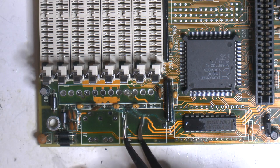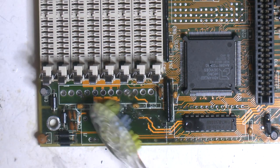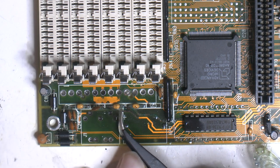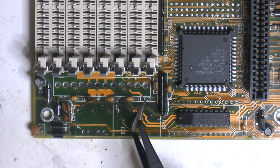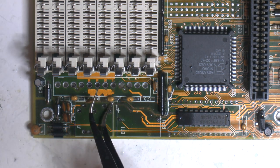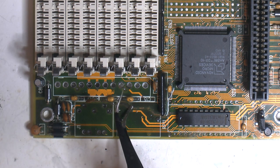Make sure there could still be some top coating left, so I can't scrub this corrosion away, but I don't think there is. It's just very thick corrosion. I'm gonna have to tin this and wick this later. Get even more corrosion away, and once it's all taken, tin solder, we can do a final soldering of the traces to basically give them a new coating of the metal layer, taking the copper with some tin, and at the end we can conformal coat them so they are protected even more. But that will be probably before we solder back some big components that might be in the way, so we might cover them up. Want to do that.